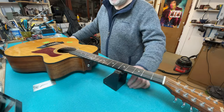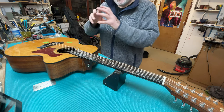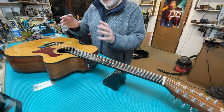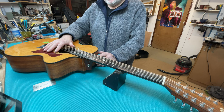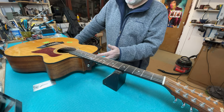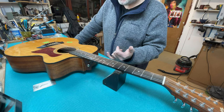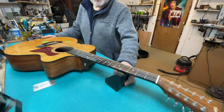You may find a secondhand battery case, but you can't buy a new one and they go for quite huge prices. That then doesn't help with the pickups, which are gnarly - the first one was completely broken off, with tiny little wires that start to melt the plastic when you try to solder them. The preamp comes alive with battery power but nothing's happening from any of the pickups. The one possibility of making this system work again would be to discover that the neck pickup underneath the fingerboard extension was broken or disconnected, in which case you could possibly buy another one for about 40 quid.